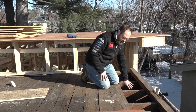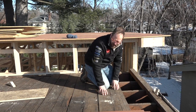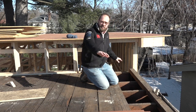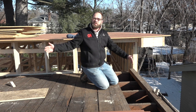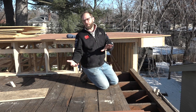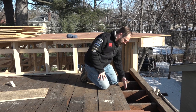We're going to insulate between the ceiling and the subfloor here, but this is not the finished surface. Over the top of this is all the framing, another layer of our Zip sheeting, and roof decking — that's all going to get taped. So our air barrier is going to be up here. And then we'll actually have a small pocket of dead air space that's impossible to vent, and we'll have about R80 sitting below that.